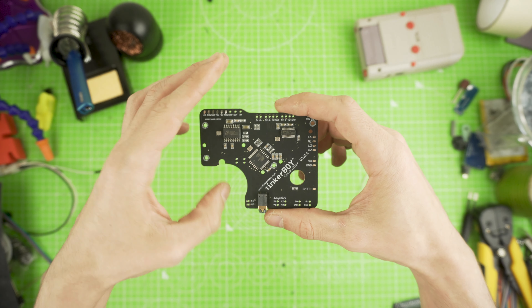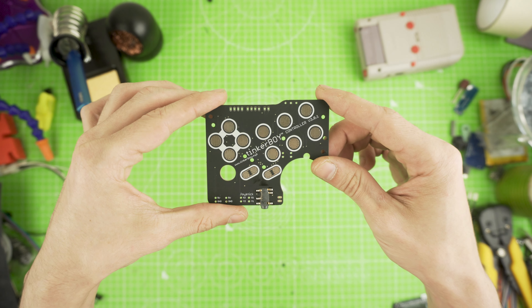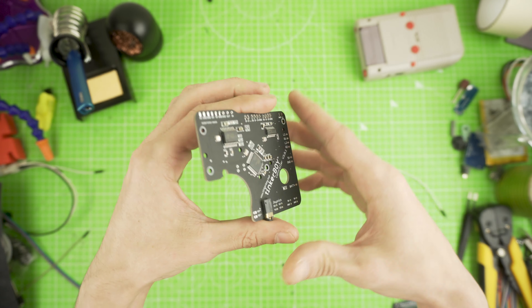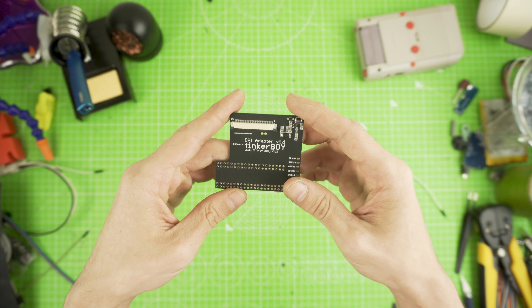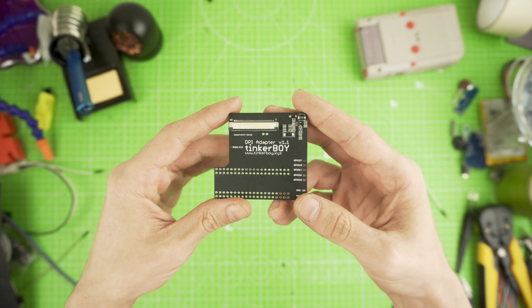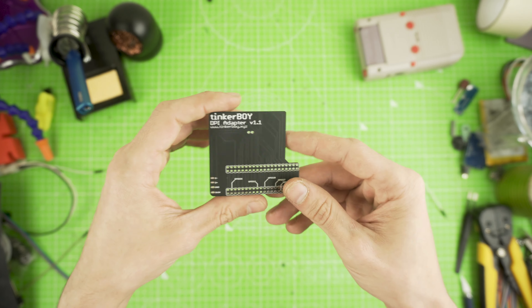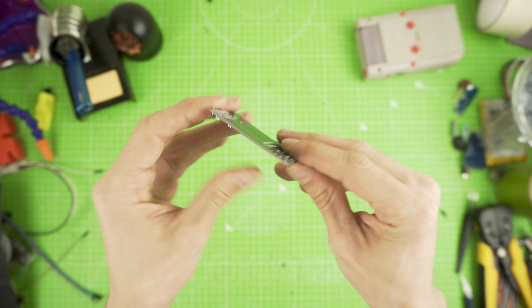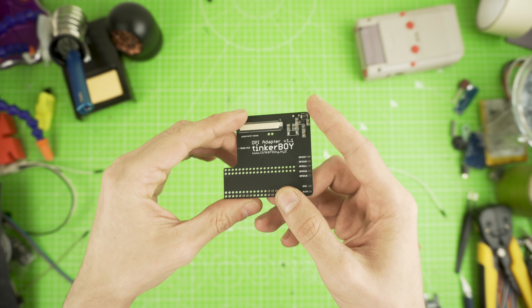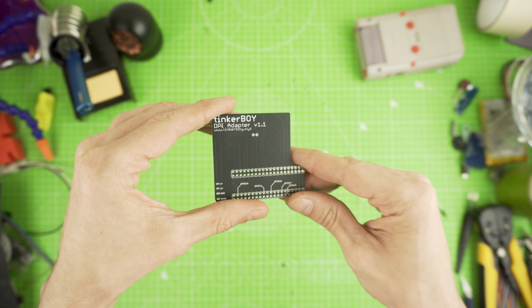For our bottom PCB, I went with Tinkerboy V3. You can't go wrong with this one — it proved reliable and is inside each one of my builds. This goes well with the Tinkerboy DPI adapter; it just sits under our Pi, being soldered on all 40 GPIO pins. This will provide us with a fast way of connecting the screen to our Raspberry Pi, being faster than any SPI screens I have tested. You will also have 5 spare GPIO pins labeled on the side of it, which are free to use for whatever you choose.